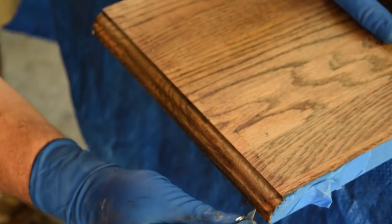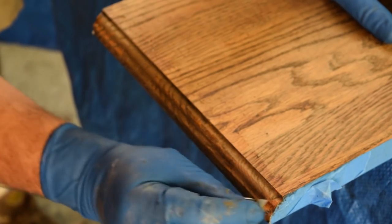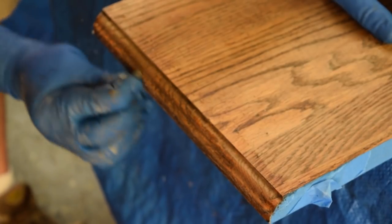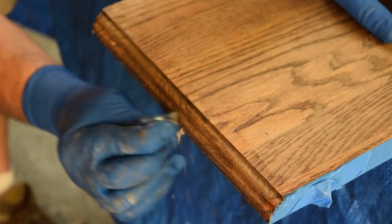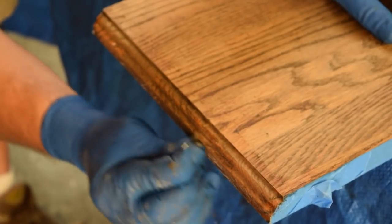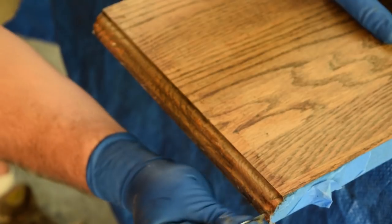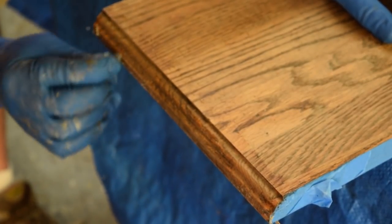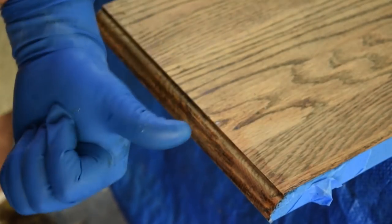To get it off. And you know, there's a myriad of different shapes of little scrapers you can buy if you so wish. But in general, I find with a razor blade and that brass brush, I can get off most stubborn stuff. And then also you can use steel wool in the stripper or lacquer thinner or whatever thinner, depends on what finish you're removing, of course. But that's pretty much it.